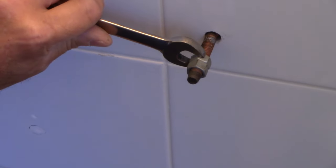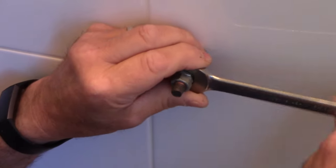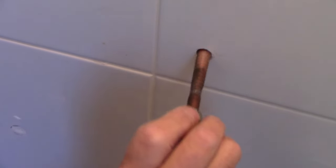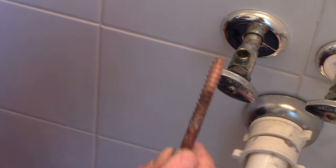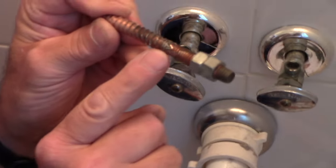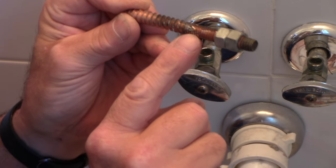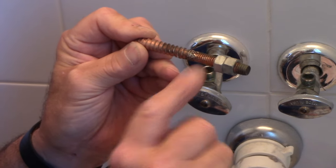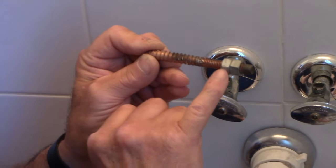Take the nut in the back, turn it, and rotate it out — that's all there is to removing or extracting a bolt screwed into the wall. Look at the threads on here: you can see whoever put this in didn't use this method and actually damaged the threads — the nuts wouldn't screw down any further without a wrench. If you use this method you'll never have that problem; the threads will always be in perfect condition.